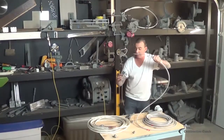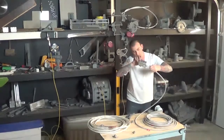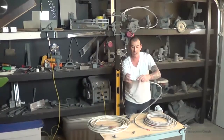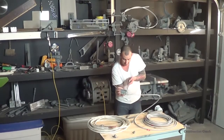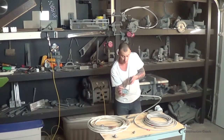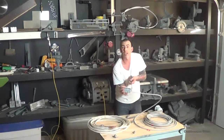Once you've got it flush, bring it through the connector, keeping it nice and tight to the face of the connector. You can see that little tab sticking through so the inspector knows it's been installed. Once through, tighten down on your clamp and ground your ground wire to the ground screw in there. Wrap your wires in and you're ready to carry on.